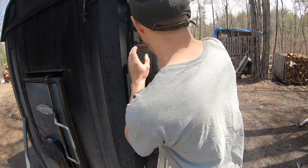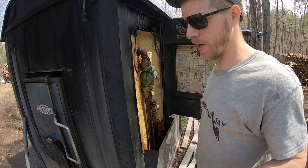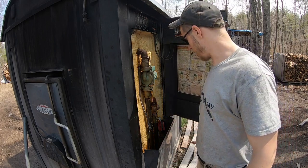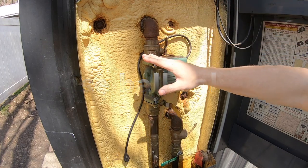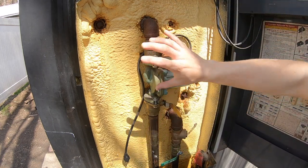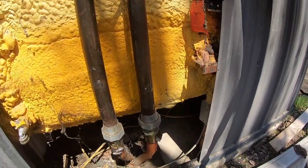The machine is cold, no fire in it, ambient water is around 86 degrees. Per Central Boiler, you need to drain it when it's 90 degrees or below - that's your cutoff. We're going to unplug the circulator pump, pull the side access panel, and drain the water. You want to make sure these two valves here are shut so you don't get air in the system, and when we fill it back up it'll refill without any air pockets.